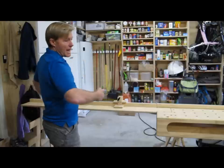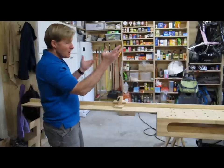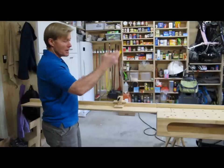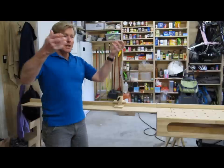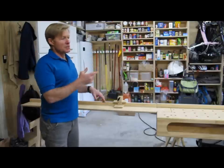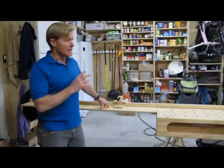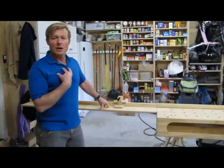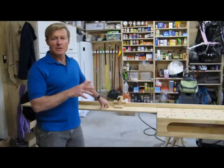With this long fixture, I can have 16-foot or longer material stored there and just work with it — cut it, cope it, store it, haul it in — and I'm not taking 16-foot goods and trying to move them around. That's just to point out: don't overlook the saw horses. In my workflow, they are the most important part of any miter saw stand. Stop the material at the saw so you're not moving back and forth.